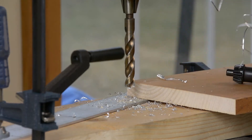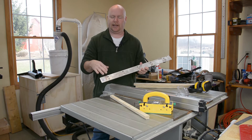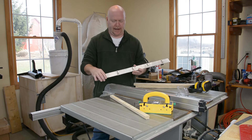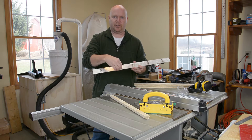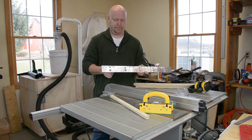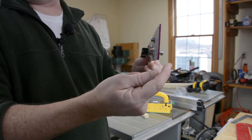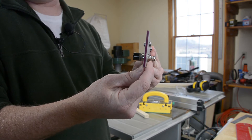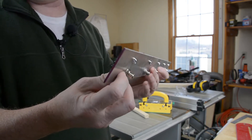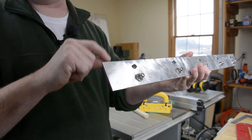The joy of aluminum, folks! Once all the machining is done on the aluminum you can hit it with a flap disc just to take any little burrs off, clean the oxide off if you want, keep the edges from getting too sharp, stuff like that. The foot switches screw into the big holes and the LED lamp holders screw into the small ones. They have a pretty long thread on them so there are two nuts, one for the back and one for the front, and you have to kind of guess a little bit to make sure that you get them all set at the same height. This is what it looks like — this is where your foot's gonna go and the light will come on here.